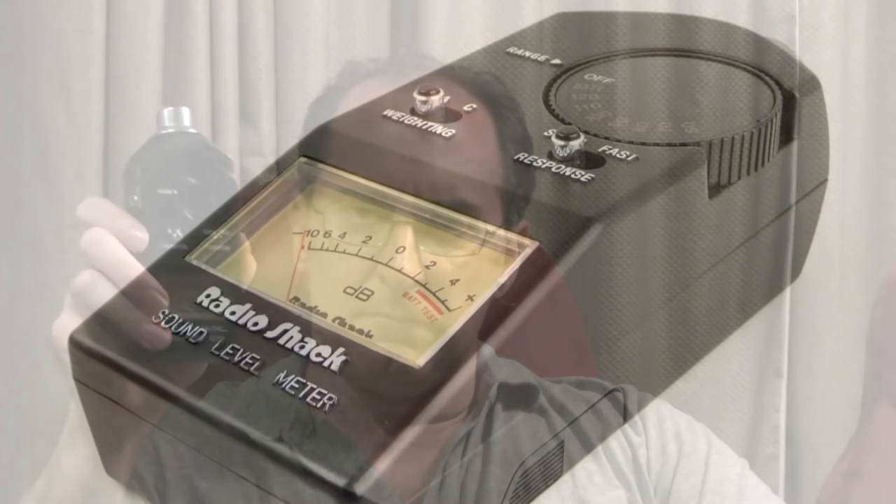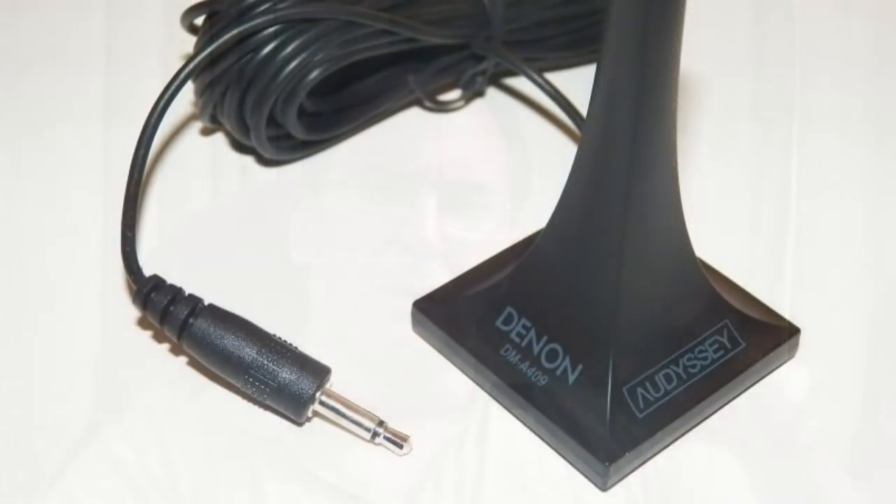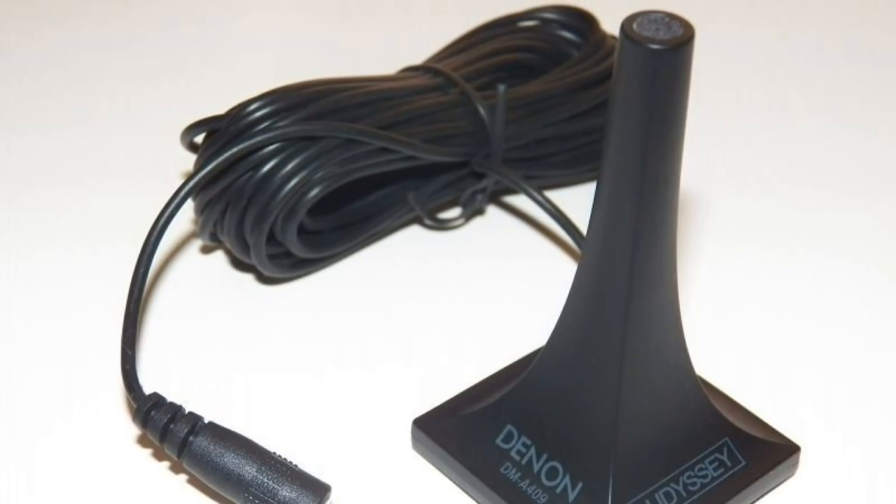For those of us that like to do it the old-fashioned way of balancing our channels, this little device is very useful. Mine is an old analog SPL meter from Radio Shack. You might still be able to find some of these on Amazon. A lot of them are digital now. I do prefer the analog one because you can see the meter and the response is a little quicker, more instantaneous. This is a very useful tool everybody should have — even though today we have auto setup with auto equalization where you put the microphone in your sweet spot and it does all your channel trims, delays, and EQ. That's all well and good, but this is still a reliable tool to use and to verify the auto setup, because auto setup is rarely ever even close to being perfect.